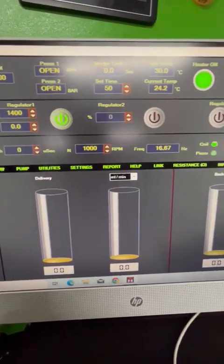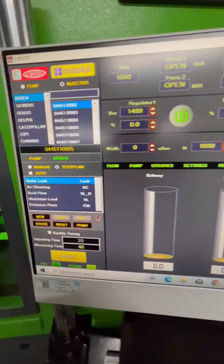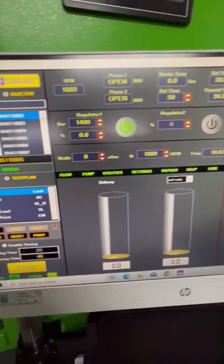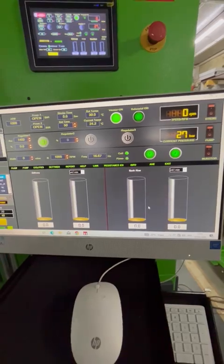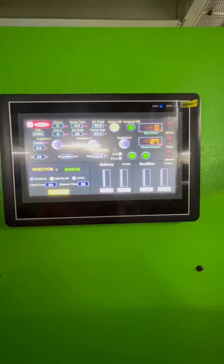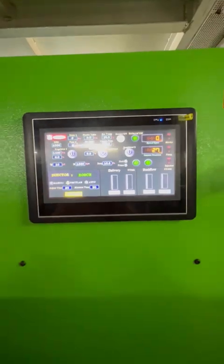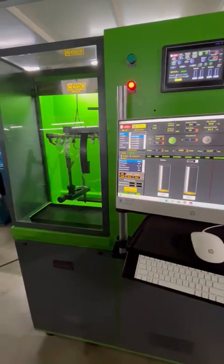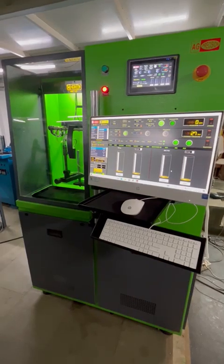The third part shows the pulse width frequency, which covers the injector settings. While operating in manual mode, the user can set these parameters himself. In test plan and auto mode, these parameters are already set in the calibration test and the machine runs automatically. The simulator also comes with this HMI touch screen — while operating in manual mode, the user can directly use the touch screen to run the machine without needing to switch on the software. This machine also has an inbuilt heater and chiller, which controls the temperature at 40 plus or minus 2 degrees.